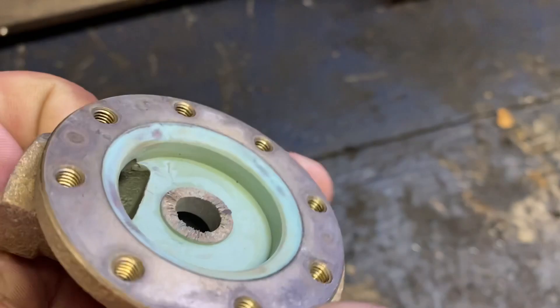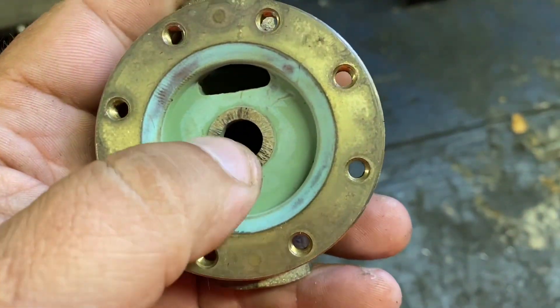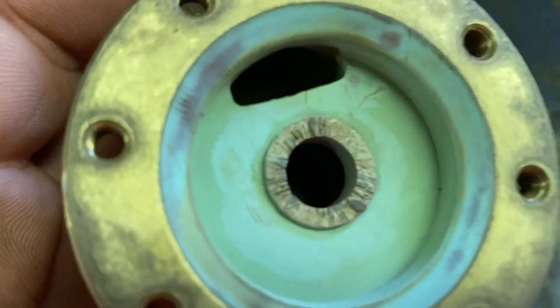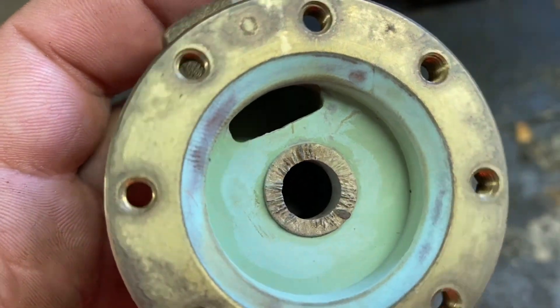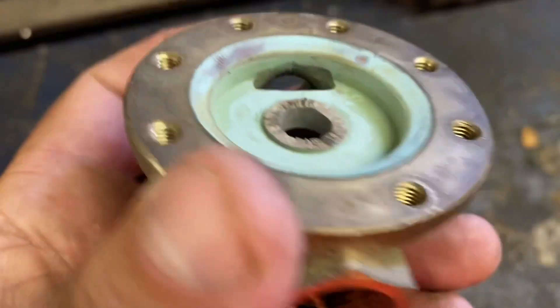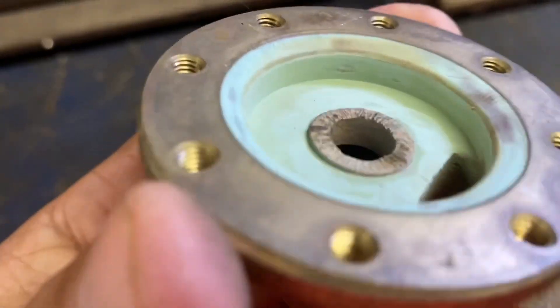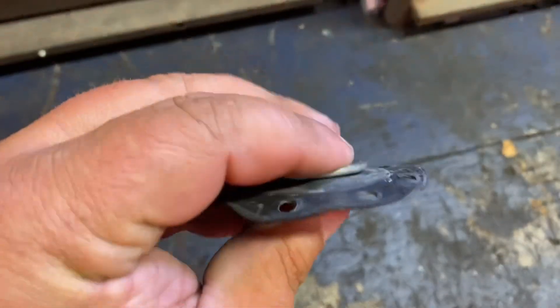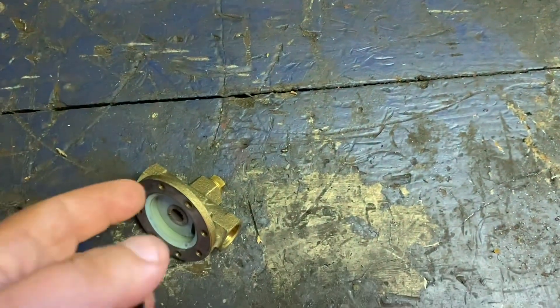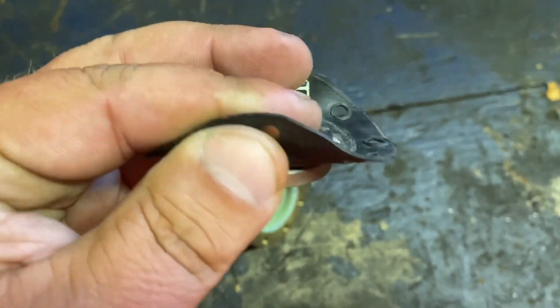What we're going to do — I think there's enough meat left. We'll chuck this up in the lathe and just give this the barest hint of a cut, try to take most of those ridges out there. Hopefully we'll be able to take them all off. As you can see, it doesn't sit very proud of that. We can take this down because there's more flex in this — if we take 20, even 30 thou, this will make up for it. There's plenty of flex in this.